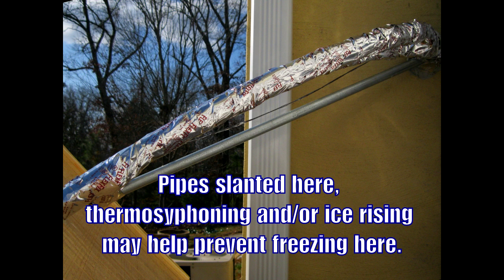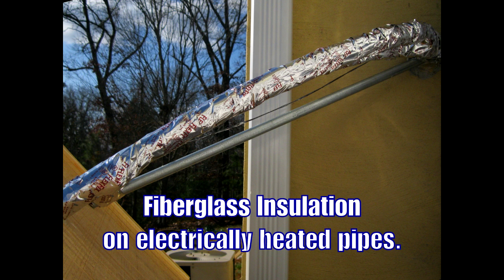Here are the pipes going in. The bottom is a metal conduit pipe carrying electric current to a heat tape on the two three-foot pipe sections. There's a cold water pipe going into the box and a hot water pipe coming out of the box and into the house. An electric heat tape was needed in case of possible freezing. The heat tape is attached to the bottom of the two three-foot sections, and should the water temperature in the pipe drop below 38 degrees, the heat will come on. It's only about 40 watts and will keep the water from freezing in the pipe as a preventive measure, since the PEX can expand somewhat, but this eliminates worry in the most vulnerable part on very cold days.